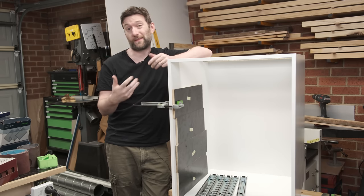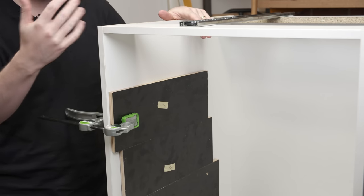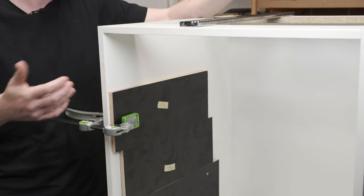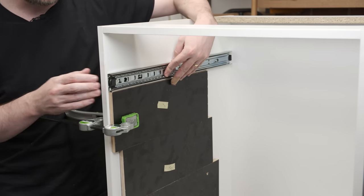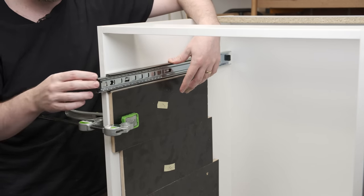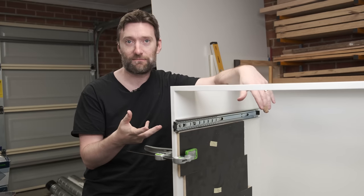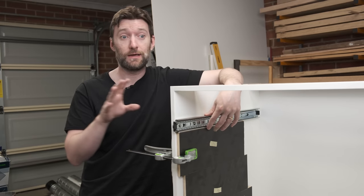It's derived from a Welsh word - that's a backronym - that explains the system of installing drawer slides. I have 20 something drawer slides to install, which again I could measure everything but that would be really annoying. Instead using these spacers - in this case evenly spaced at 150mm pieces of scrap plywood - they're stacked on top of each other and clamped in so they can't fall down. The cabinet side of the drawer slide just gets butted up against that and a clamp called gravity holds it in position vertically so I don't have to fight it. Pre-drilling just a couple of mm deep just through that melamine layer makes the process go a whole lot smoother.